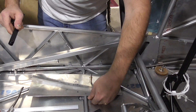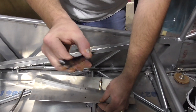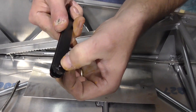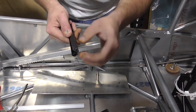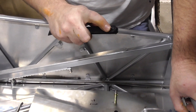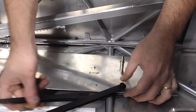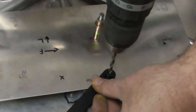How are you gonna find that hole? I've already put the belly skin on, so we can't drill up this way. They make a hole finder and it's so simple. This is a number 11 hole — each one is different, so this is for number 11 and then I have the 30s, 40s, whatever down here. You find the appropriate size, which is number 11, lift this up, slide this through, and the little button on this side is sized for the hole. Slide that guy up and under your material — it seats down into the hole and straddles the material. Now this side is ready to drill. It's a little drill guide.